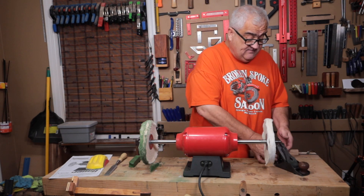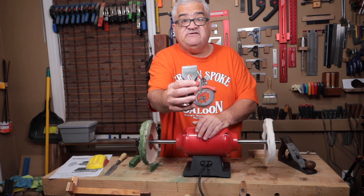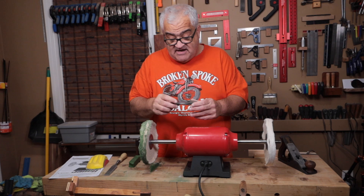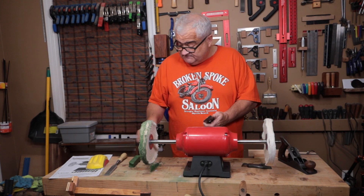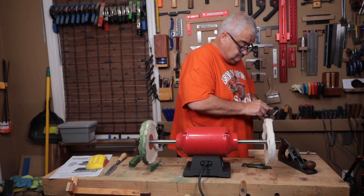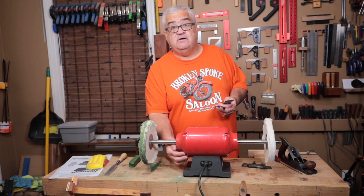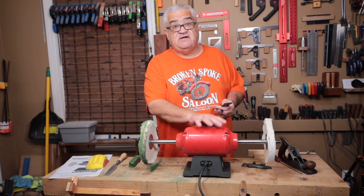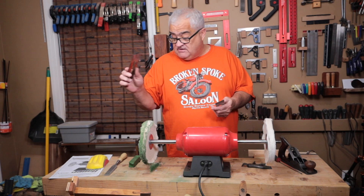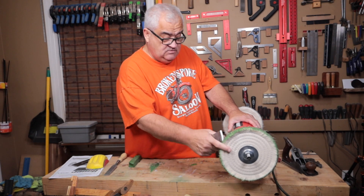I have a plane here — this is really my use case. Let me take this apart. While I'm doing this: I did take the wheel off and tested the other three screws — the other three were nice and tight and I tightened the loose one back up. Going with something that vibrates this hard, a bolt could loosen. I'm not going to put the blade to this yet, but let's see if I can buff up this chip breaker a little bit.